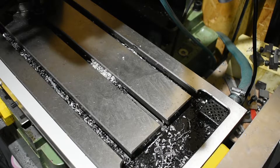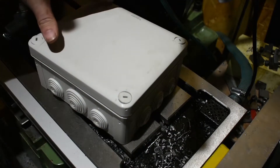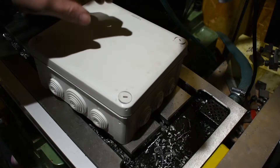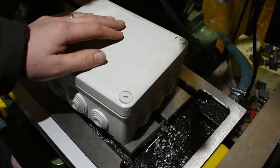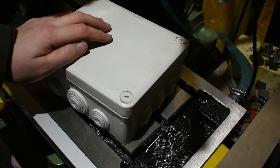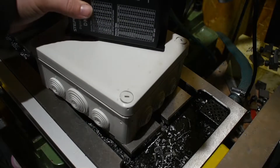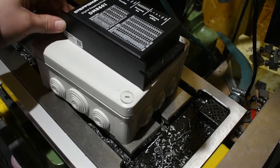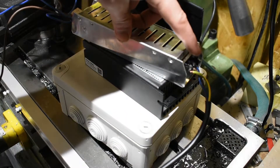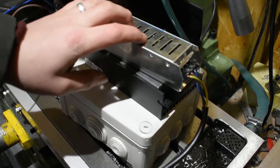First of all I'll run you through the parts I've got for this part of the project. I bought a junction box, about 200mm by 150mm, and the intention is to use this to mount the switches and get as much of the controls in there as I can. I'm hoping to get the stepper motor controller in there, but if we're tight for space I might have to mount it outside. We also have a stepper motor driver and a transformer which is going to convert 240 volt to 12 volt — that won't fit inside the junction box so I'll mount that outside.